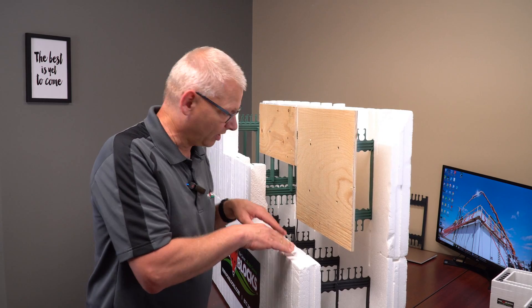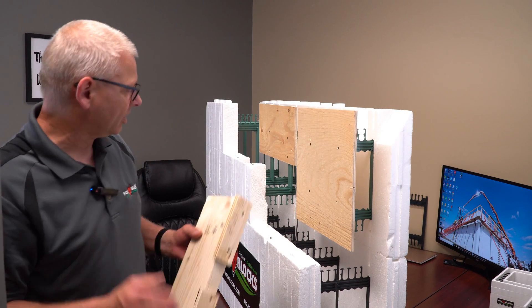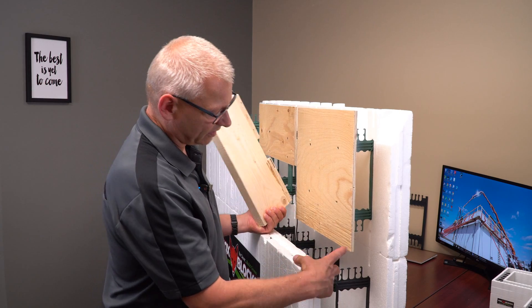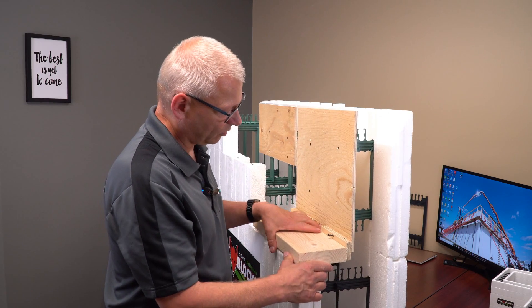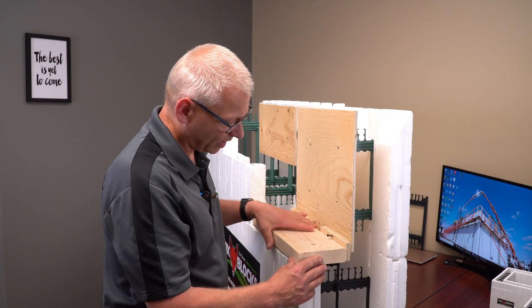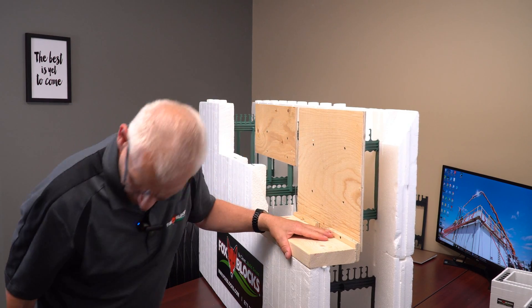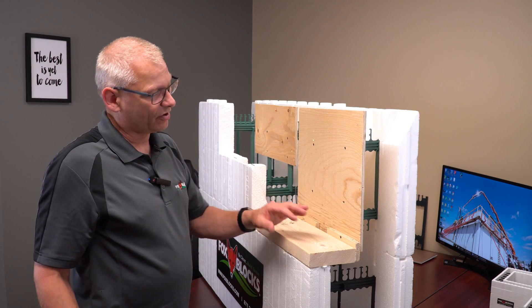On the bottom here I did not do a taper. You may not need it because it's going to give you a four-inch ledge of concrete, which is more than enough for a wood floor. You would typically want to just leave it like that and place concrete — you can trowel it off and later on put your sill on, or sometimes you want to get the sill on first. I took a two-by-six; I knew this was six and an eighth because I used three-eighths plywood. If it was half-inch plywood it would only be six-inch. I put some scraps on to space it, and you could put straps on the front as well and make it solid in the back. This allows me to easily screw the sill on. Now I can place concrete, run the vibrator down there and consolidate it really well. Every so often I can put a strap on here with a couple of screws just to keep this from lifting when I consolidate. That gives me a really nice curb.